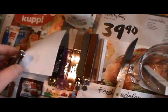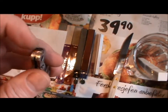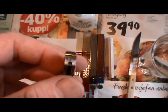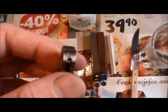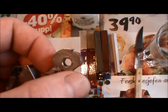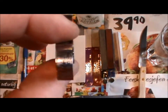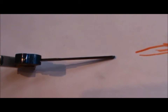There were some burrs - I could feel them clearly on the sides and a little bit inside, because it rubs my paper and gets a hole in it, meaning something is sticking up. I don't think this is necessarily required, but when I'm finished with my sear and full cock notch I don't want anything to ruin my surfaces - that's the main reason.